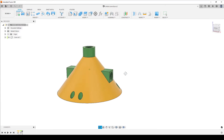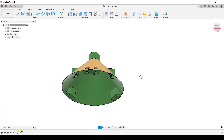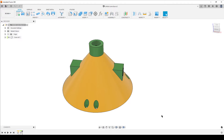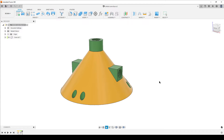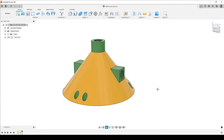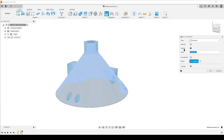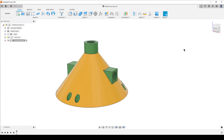I have a design here with some cutouts, sensors, and mounting holes just to have some more geometry on this cone face. This is a derived component I pulled in deliberately so I don't have any sketches — just geometry. If you have a STEP file import you should be able to do the same workflow, as long as this is a true cone. We're going to use the sheet metal functions, which need a developable surface — one that can only be bent around one axis. A cone qualifies. I've created a new component called 'cone face flat' where we'll place the flat pattern.